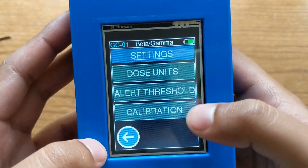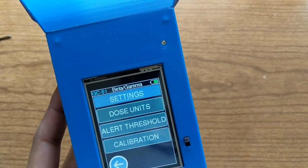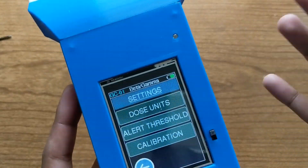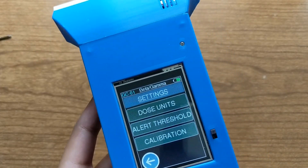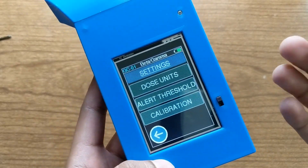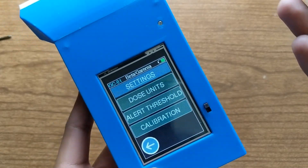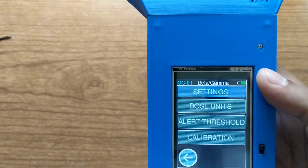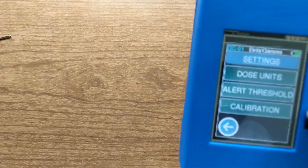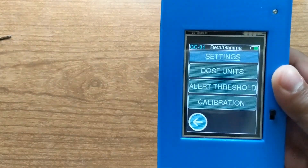So that's calibration. The actual process of calibrating a Geiger counter against a source is a lot more involved — you need a disk source of known activity, and you need to know the exact energy profiles and fractions of all the beta and gamma emissions. Then you use formulas to calculate the dose rate at a given distance, relate the count per minute at that distance to the dose rate, and find the conversion factor for that isotope. I don't have one of those disk sources yet but I did order one, so I might make a video about calibrating an SBM-20-based Geiger counter with a cesium-137 source once I have it.